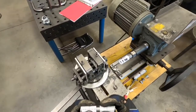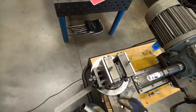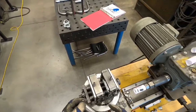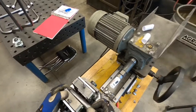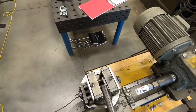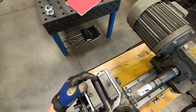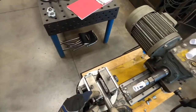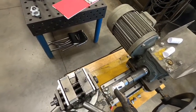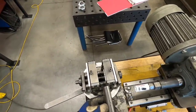I'm going to slide these wrappers off and set the tube up in this jaw. When we go to set this up, we can't use too short a piece of tubing because it needs to be held tight enough while being cut by the hole saw bit. On this piece in particular, it's short enough that I may not be able to clamp on both sides — especially for the second side when I switch it over. If you can only clamp one side, make sure it's in there tight enough. If not, it'll get pulled and jump once the blade catches, and can either damage the hole saw blade or deform and ruin your tube.